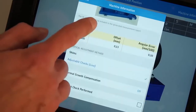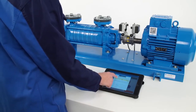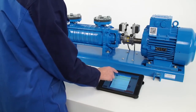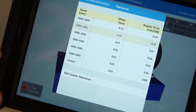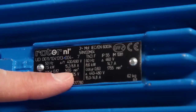Tap on the tolerances table. The system uses tolerances to decide if the machine is aligned or not. The operator must enter the tolerances for the machine based on knowledge of the machine and coupling type. Alternatively, a table of preset tolerances based on motor speed is available. Read the speed of the motor and select the corresponding tolerance.